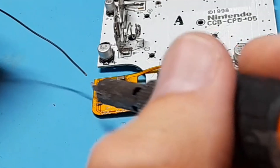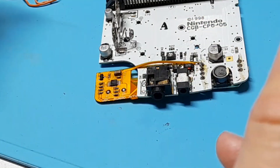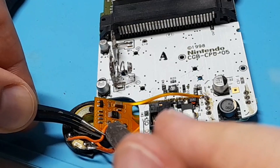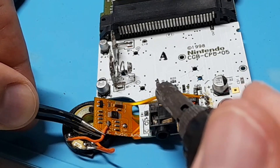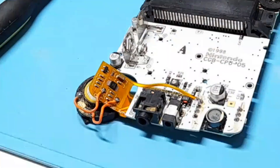There are two circular pads on the amplifier for the speaker. We're going to add a little bit of solder to both and then attach the speaker. Again, it probably would have been easier to tin these while the ribbon was off. Once those pads are tinned and your amp is installed, solder your speaker to those two points.